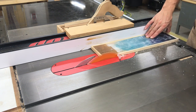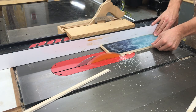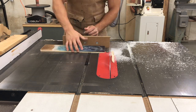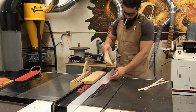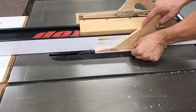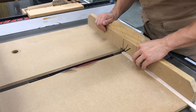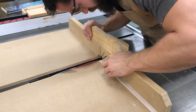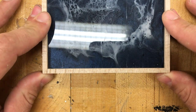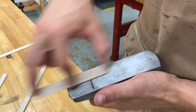The frame for the pouring was just a pine frame from a big-box craft store — it worked great to hold the resin in, but it doesn't look great as a finished product. So I cut that off and set about making new trim for the box. It's just some curly maple I had lying around, cut down to about a quarter inch higher than the final dimension and trimmed to length. I took my time making sure they were the perfect length because there's not a lot of play — if the miters don't match up it ruins the entire effect.